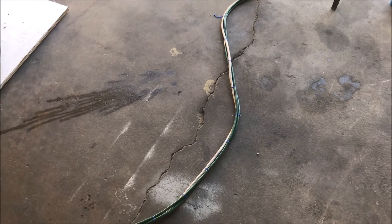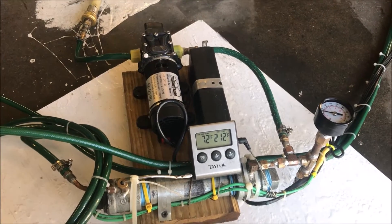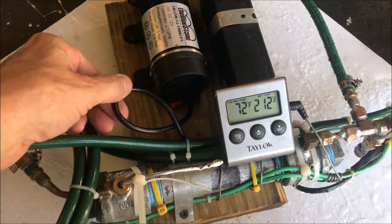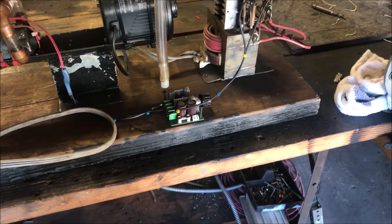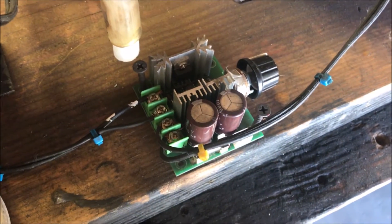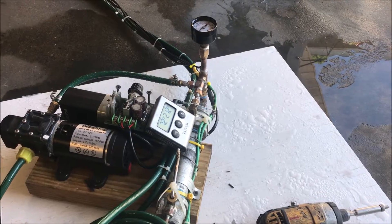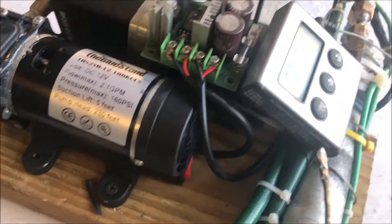This was actually a great test — I did not get the information I wanted, but I did end up with some info that may keep me from getting sued in the future. It may be cheaper to just put a $10 PWM on this motor, but will we be able to get the pressure we want? I'll go ahead and harvest a PWM off a prior build — I use this thing all the time. I bought this off eBay and I'll leave a link in the description. I do recommend when you buy it that you stiffen up the potentiometer because it will inevitably crack loose.